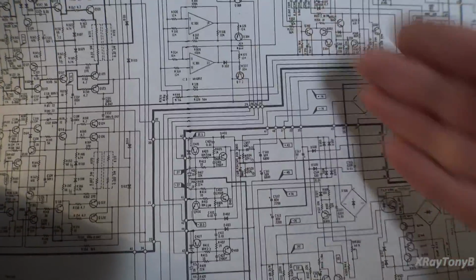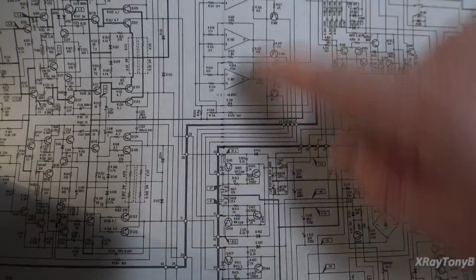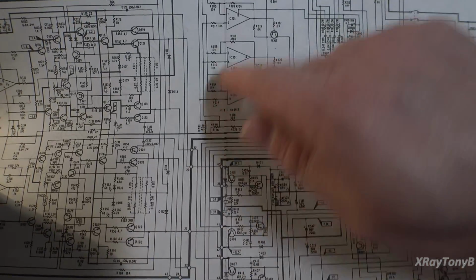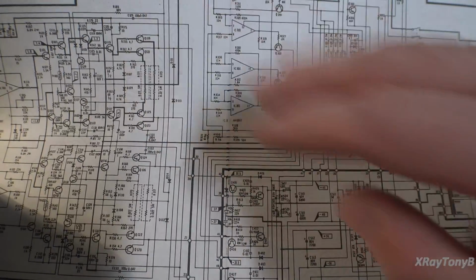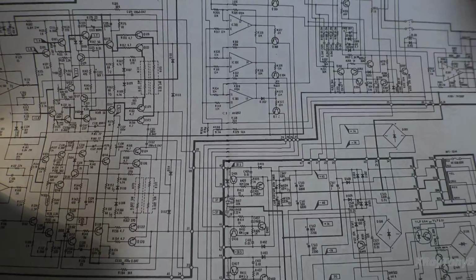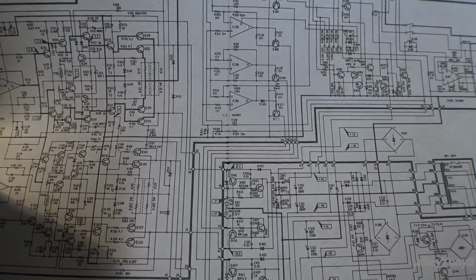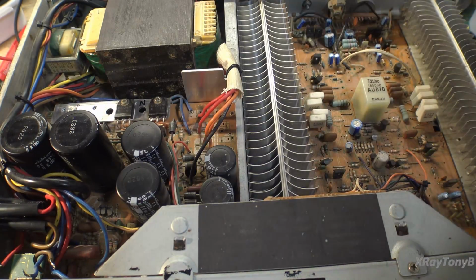You have to remember, this transistor has to switch between the two power rails very quickly. It's in the middle of a cycle. In other words, the sound is coming through, the amplitude is rising very quickly, and it has to, right mid-stride, switch in that 74 volt supply. So the rise time is very important, and conversely, as this amplitude is decaying, it has to be able to shut off very quickly. And that's why I think they use these special transistors with higher transition frequency.